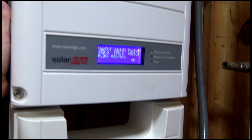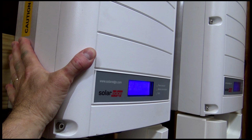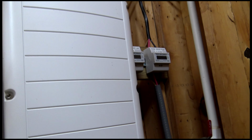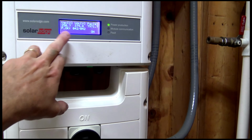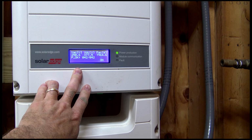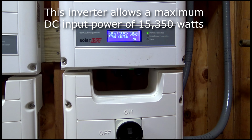Now this one is a different design. It's got active cooling fans in it, whereas this one's all passive. So I can touch these aluminum panels right now, and they're warm, because it's got about 1% losses, and then there's hot air coming off the top. This one has active cooling fans, and this one's just passive convection. So I didn't know that this one would go higher than 11.4, but it was up to 12.2, 12,200 watts. So that was really surprising.